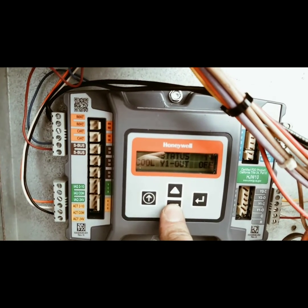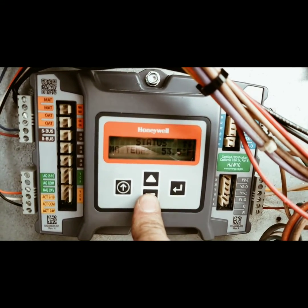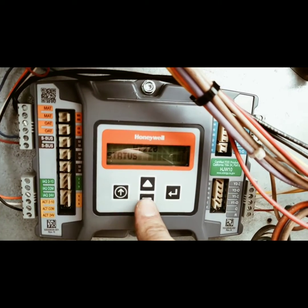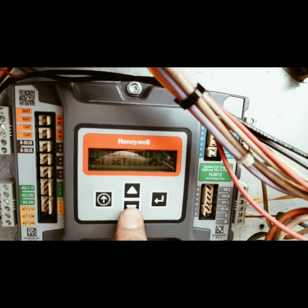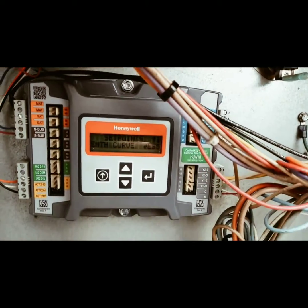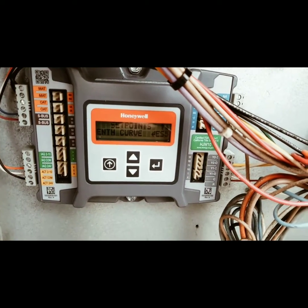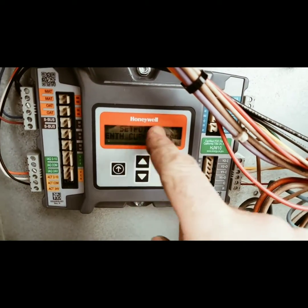There's a bunch of stuff in here but one thing I want to show you: it will display your mixed air temp — that's the sensor inside the blower section — your outdoor air temp, and your humidity, which is really cool. Under set points, we have our mixed air set for 53 degrees. This is your enthalpy curve — you have to watch this because depending on where you are, your enthalpy curve will be different. You've got to look in the manual for this. I'm in Toronto, so my enthalpy curve is set for ES5. Keep an eye on that when you're setting it up.